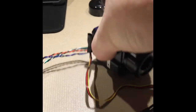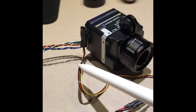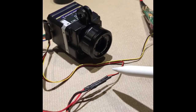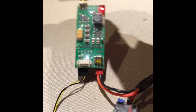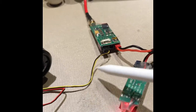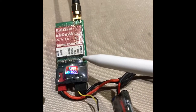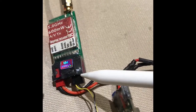This cable right here is a data cable that you have to buy as an extra accessory. These are typically called GoPro Hero 3 cables. They have a video and a power output on them. I've had to splice this one, but when you get them they'll have just the regular servo connectors — sort of that three-prong connector. The video is the yellow and black leads. The third one in is the video and the second one in is the ground, so we want the video and the ground to hit those two pins.